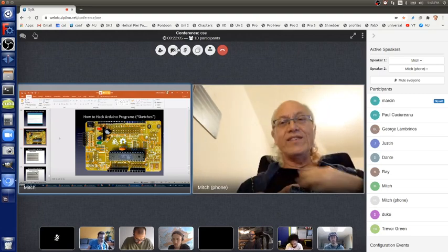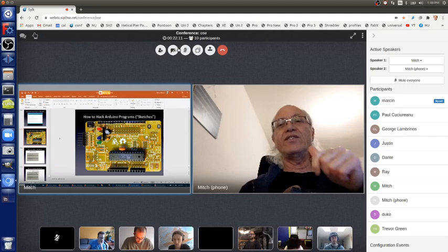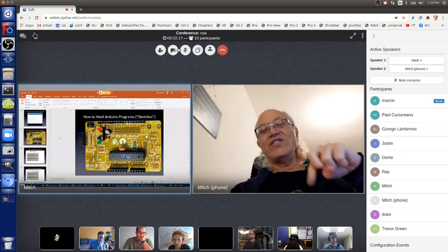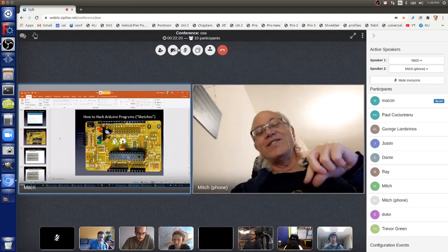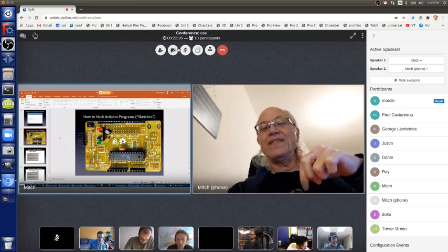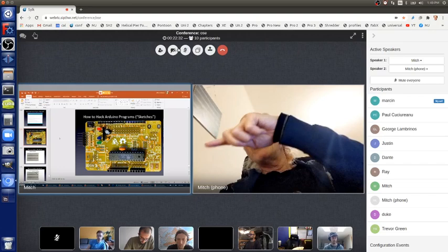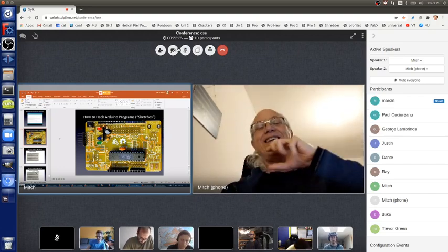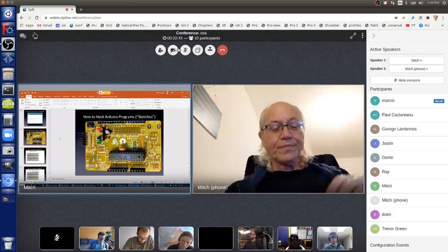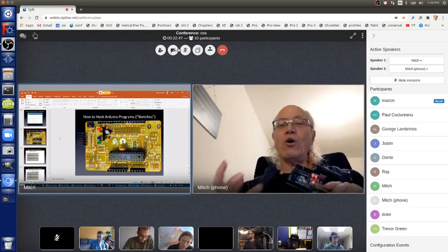The internal one is also lighting up, but it's kind of dimmer because this one's stealing a lot of the energy. And it's stealing more of the energy because I cheated again. I don't have a resistor in series to guarantee the magic smoke doesn't go away, but there are built-in resistors in this chip that do that for you. And normally you don't want to do that. On a solderless breadboard, though, we have more holes, so we can add an LED and a resistor, and I'll show you that next. But for now, you can see it can light up an external part. It can power an external part.